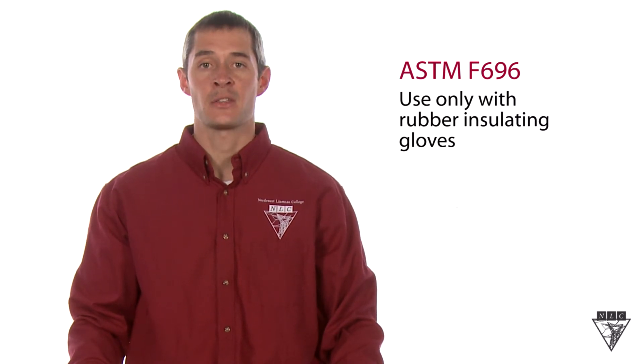This standard states that leather protectors are designed only for the protection of rubber insulating gloves. Using them in any other way could damage them or put your life at risk. With any kind of PPE, it's important to note that although it may meet OSHA regulations, improper care and abuse can void their safety rating. Therefore, it's always important to follow the manufacturer's recommendations and your company's safety rules with regards to care, usage, and replacement times. By now you understand how important it is that you make sure your PPE meets proper standards. Merely assuming that you're protected is not only dangerous for you, but your crew as well.